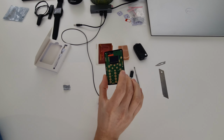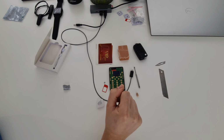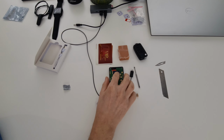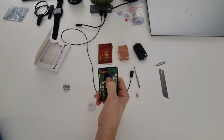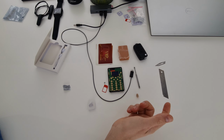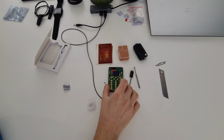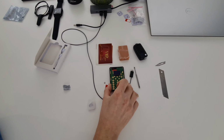After you turn on the GSM card and you hear the melody inside your AirPods, you have to wait around 1 minute. You can check the LCD screen because here you can see the GSM network provider and the strength of the signal. After that, usually 1 minute is enough. After that, your helper can call the SIM card number that you put here, and each time your helper calls, the GSM card automatically answers.